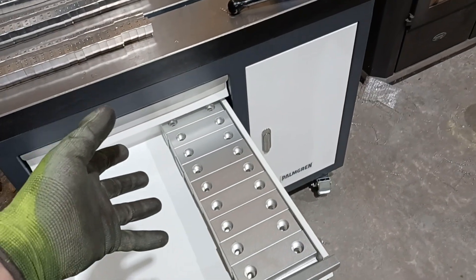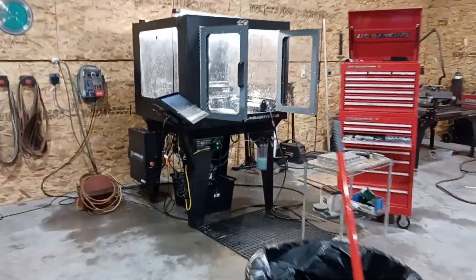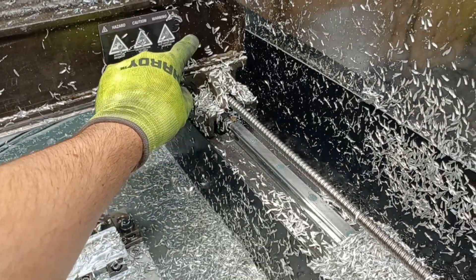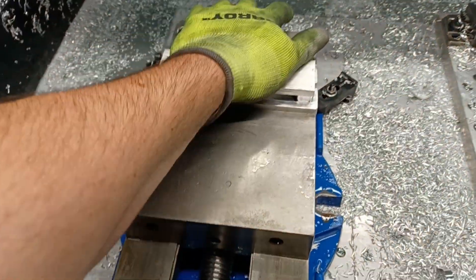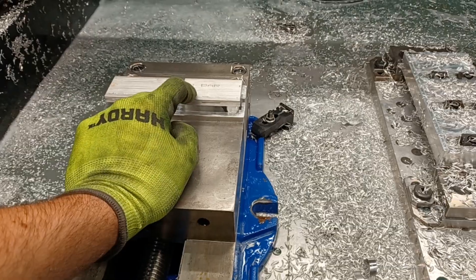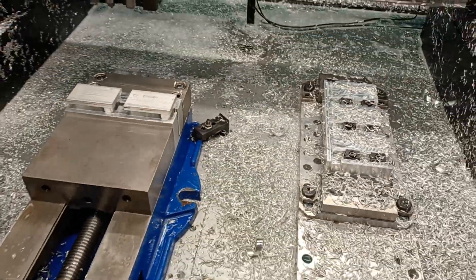I am starting to set up my MR1 for the big vise because I think I'm going to make some spacers, and then things will be easier. When I say spacers, I'm talking about right here — if I put a 2-inch spacer in here, I should be able to run big vises all the time. Maybe I'll just do a 1-inch spacer. Because when I'm running big vises like this, I'm running parts — I'm almost never putting a big piece in a vise like this. If it's a big piece, it's going to be down on the table, toe-clamped.